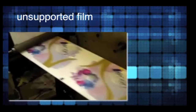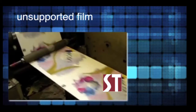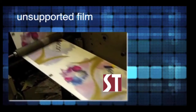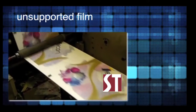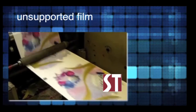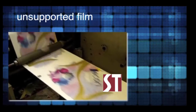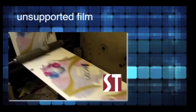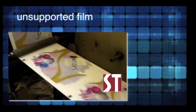The job has been set up with red, blue and black as the three process colours going down. The reason the yellow's not in is because, to test the web to see if we can get it through, we set the red in the second station. So we were working backwards and we didn't have enough material, or we thought we didn't have enough material, to actually work backwards again. Matt didn't want to waste any more.